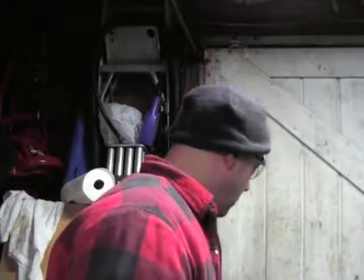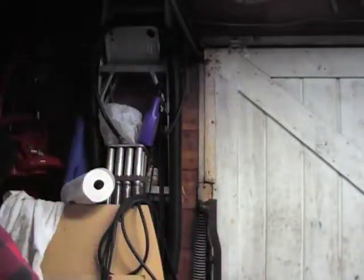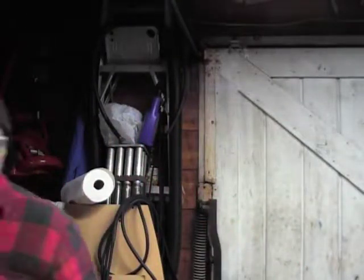just for good measure. And then later on, before I go welding on these, I'm going to take all the mill scale off. I've got an angle grinder with a flapper wheel, and I'll remove all the mill scale on both sides. Like this one here, I still have to remove the mill scale off this side, but I'm also going to weld on this side too. I don't know if you can see how it bent that way for me welding on this side. I want to see what happens when I start doing beads this way too. That'll be fun. Anyway, where was I going with this?